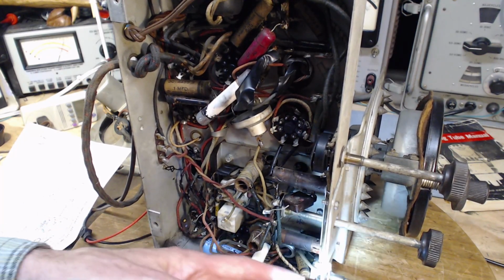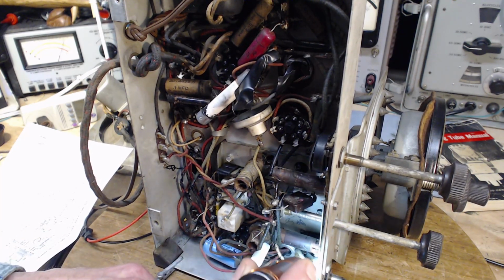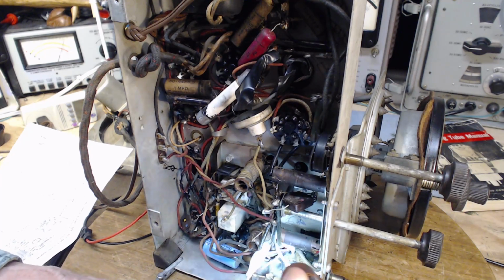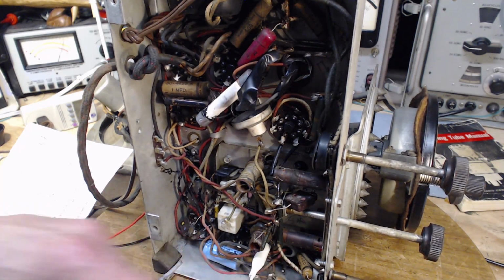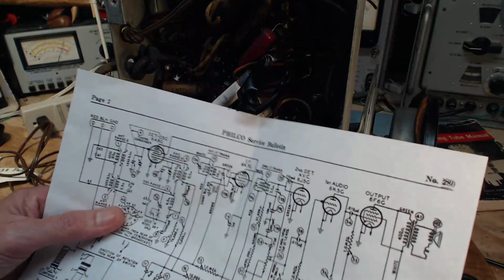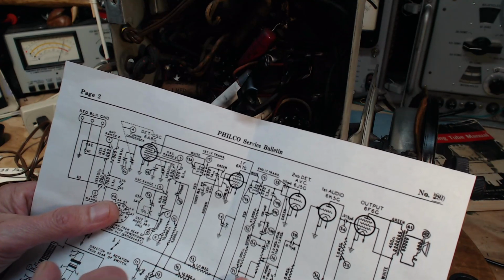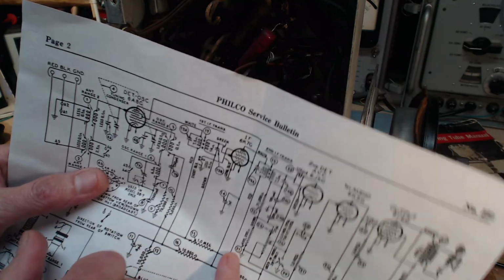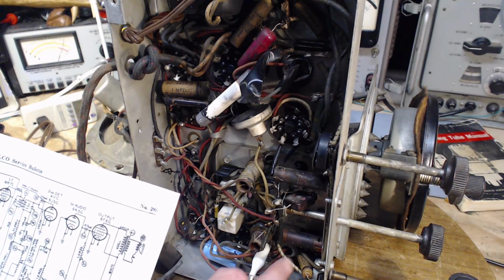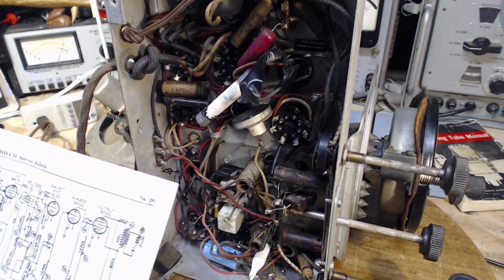Okay, so the tap on the back of the volume control goes to a resistor body and dot. Looks like it's a 20,000, 30,000 ohm resistor, something like that. Now, how's that add up with this? So we would have a capacitor coming off. Let's go this way. This way is easy, right to ground. But there's a capacitor sitting here. What am I doing here?